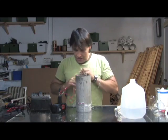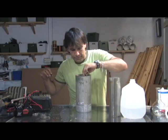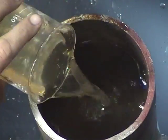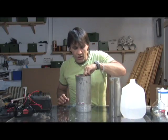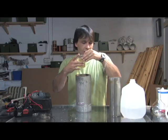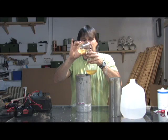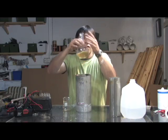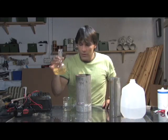One thing about this process that I find very interesting is what it does to the water. This water has turned orange. The reason it's turned orange is because the iron that was in our water has been pulled out of solution. I actually use this as a way to lessen the iron in our water — if you put a little electrolysis before 5-micron filters, the 5-micron filters are able to pick all of this up. So instead of adding chlorine bleach to do the same thing, you can use just a little bit of electricity and pull it out of solution.